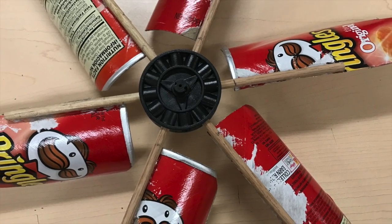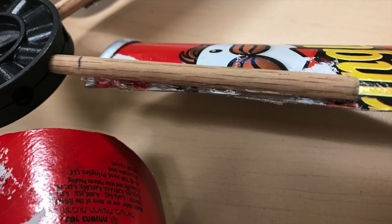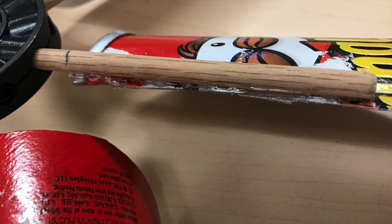We chose to attach the 6 blades to 4-inch long wooden dowel rods with hot glue because the glue is relatively lightweight and would keep the blades at the right angle. We need a sturdy connection because if the blades move or the angle of attack changes because of the wind blowing back on it, the energy we create will decrease. We connected the blades to our given hub by screwing the dowels in tightly.